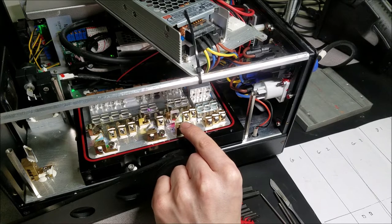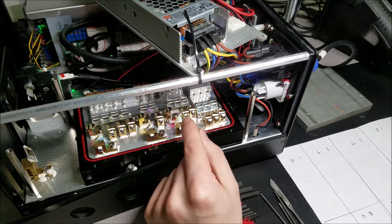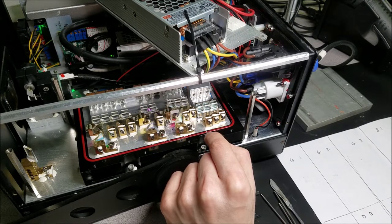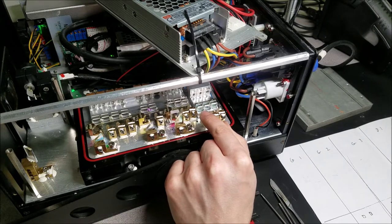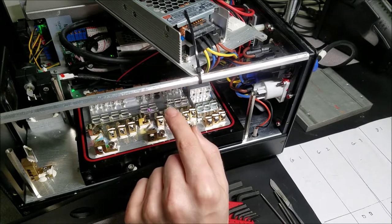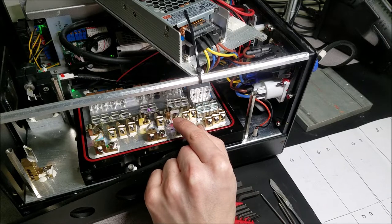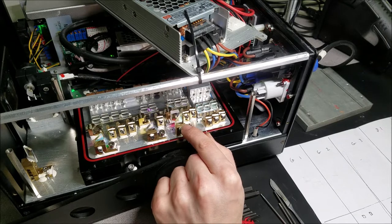And this optic right here is kind of a dual purpose optic, it's not quite a dichroic filter. It's an optic that allows light polarized in a particular way, in this case, I believe horizontally polarized, to go through this way. However, if the light is vertically polarized up and down like that, the light will actually reflect off and go this way. Even though it's the same color of light, the polarization is very important.